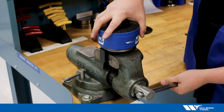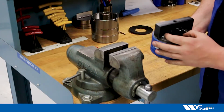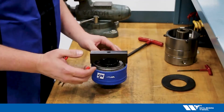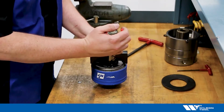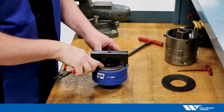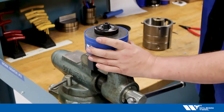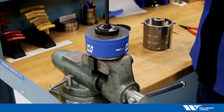Remove the tool from the vise. Back to the bench to reinstall the retaining ring. With your retaining ring pliers, simply find your grooves in your channel, open the retaining ring, slide over the punch holder, engage and track. Back to the vise — tighten back down once more, then loosen and draw the bolt.